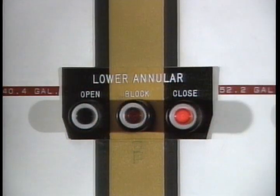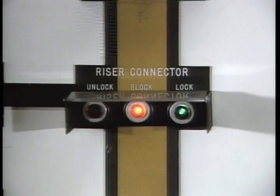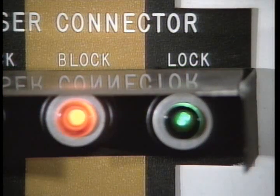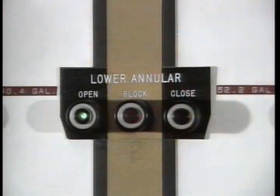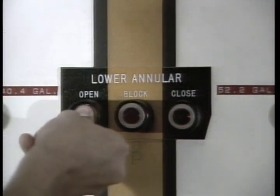The open, close, or unlock/lock buttons all have indicator lights that turn on to indicate the four-way valve has shifted to the selected position. However, these lights turning on or off is not a direct result of pushing the button or of the four-way valve handle shifting. The indicator lights receive voltage from an entirely separate circuit than that which powers the solenoid to shift the four-way valves. Each cylinder port on the back of the four-way valve is connected to a pressure switch in junction box number one. When a valve is shifted to open, pilot fluid in the respective lines begins increasing in pressure; as pressure reaches the set range of the pressure switch, the switch completes the circuit that turns on the indicator light. Conversely, the reduction at the closed pressure switch results in the closed light turning off.